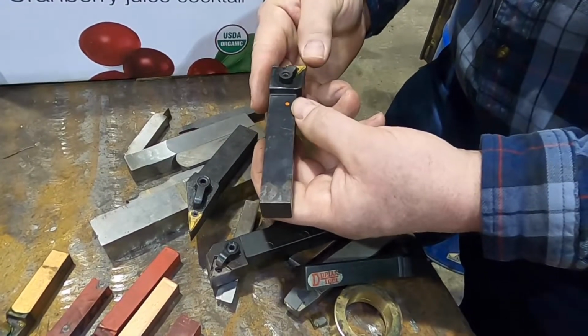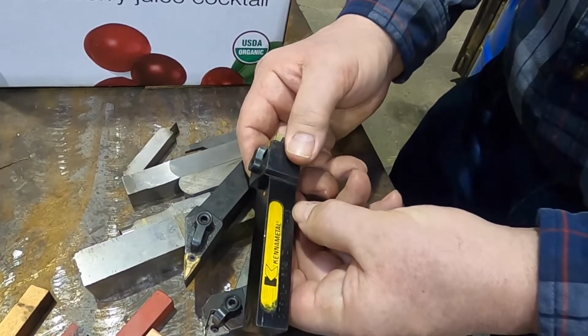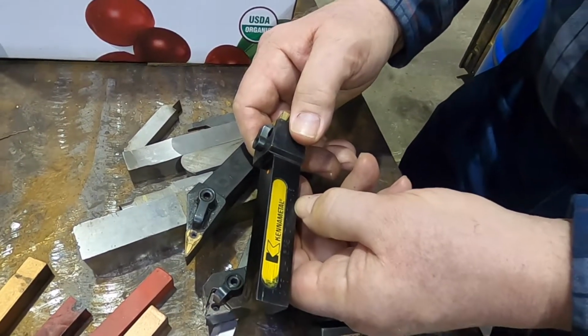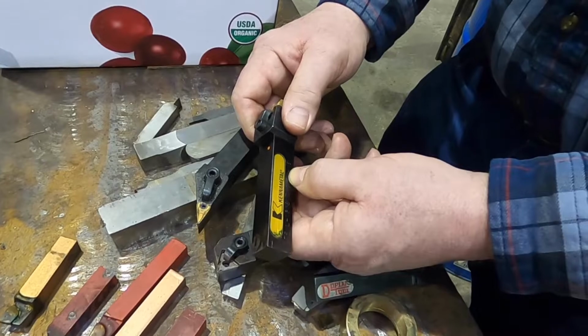And this one here is a 1/64. This is a little bit sharper than your 2s. You also, 333 is real common. Another one that you'll see is a T and U, and U is utility. And that means it either was ground inaccurately or not ground at all.